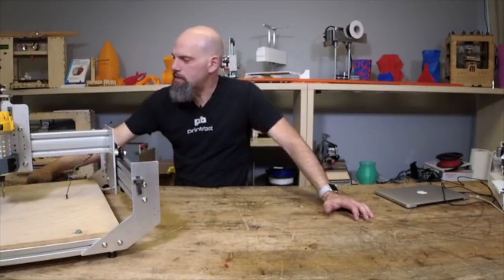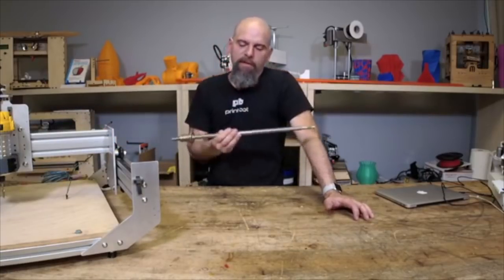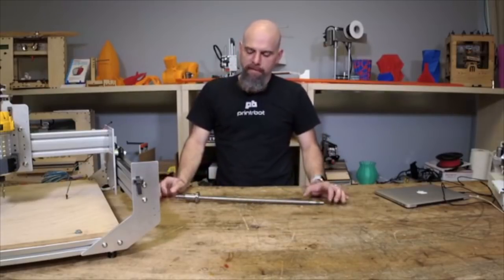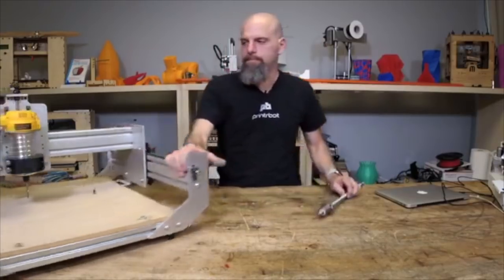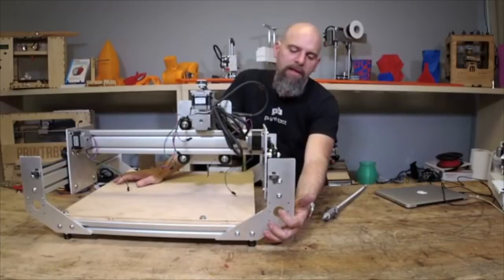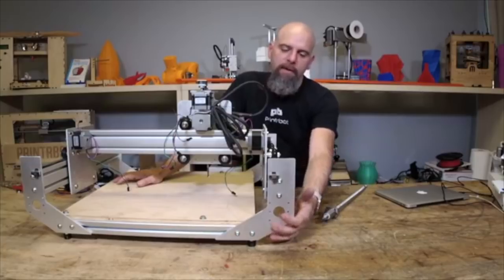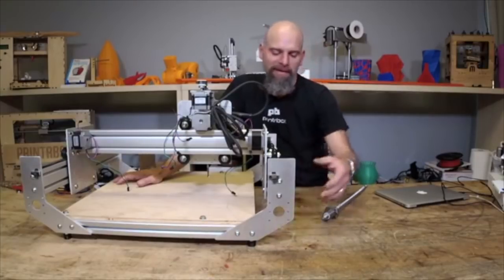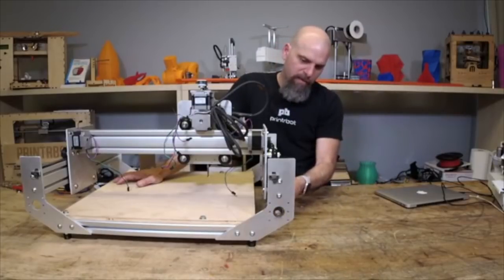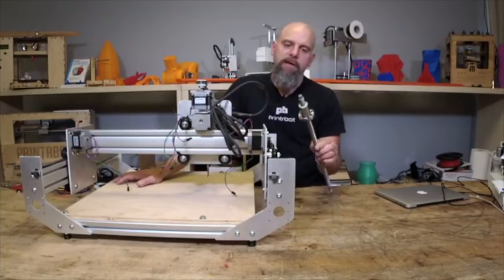The other thing is ball screw. If you have linear rails and ball screw, now you've got a machine that is pretty serious. At the back, you'll see motor mounts. These are going to ship with all these plates. We're going to go ahead and eat the cost. If you don't upgrade to this, you'll just have holes here anyway. This isn't the right size on this one, but this has an accompanying plate that will mount the motor. Very robust ball screw.